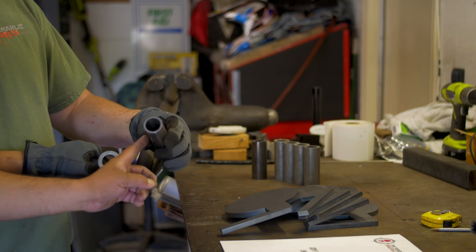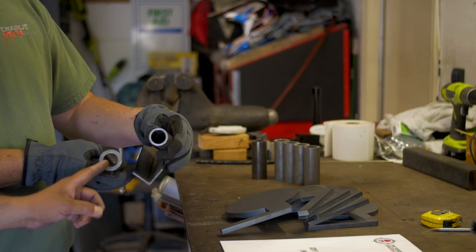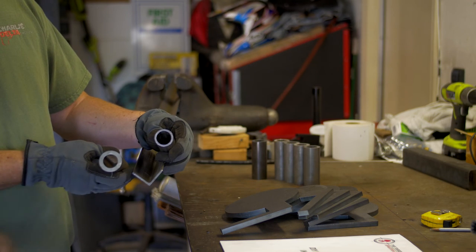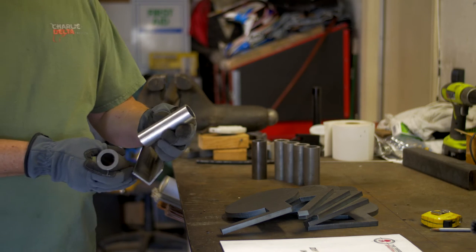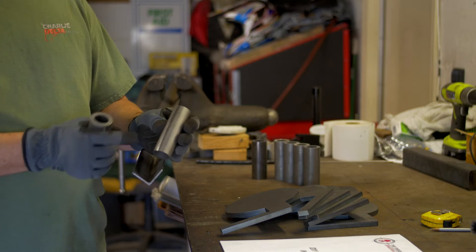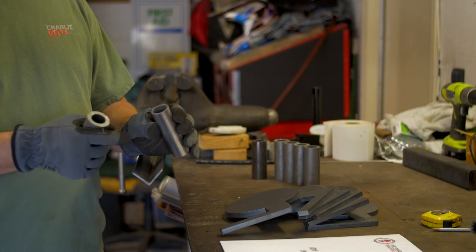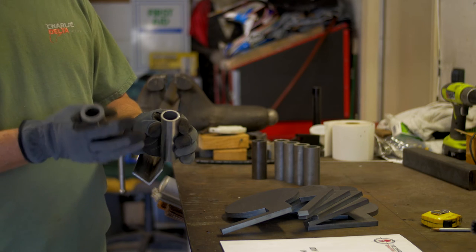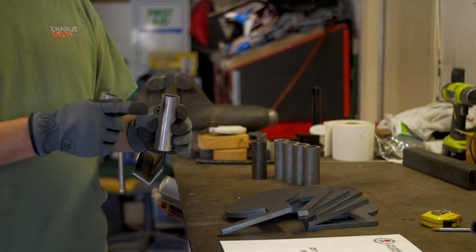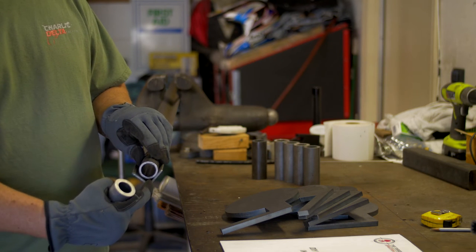Comes with this particular pivot tube, but as an option for $30, you can upgrade to a little bit heavier tube, and Greg's going to explain why it's a benefit. The tube that comes with it, the pivot tube that comes with it, is 120 wall hot rolled. You see the seam right there. That creates a seam on the inside too. It could create a little bit of a burr for the paddles when they're flipping back and forth. So if you go with this option, make sure and put that into the crevice of the angle iron.